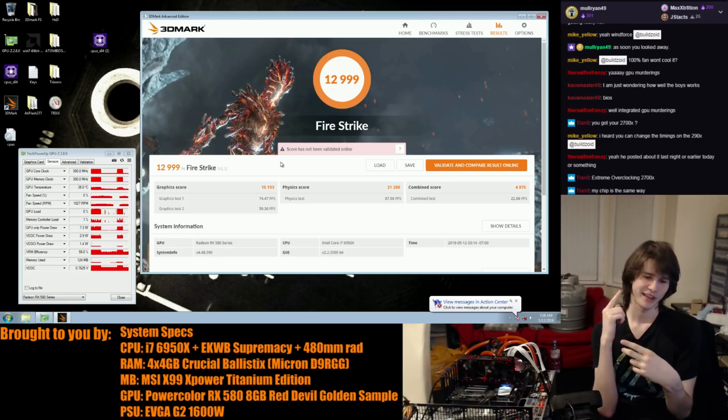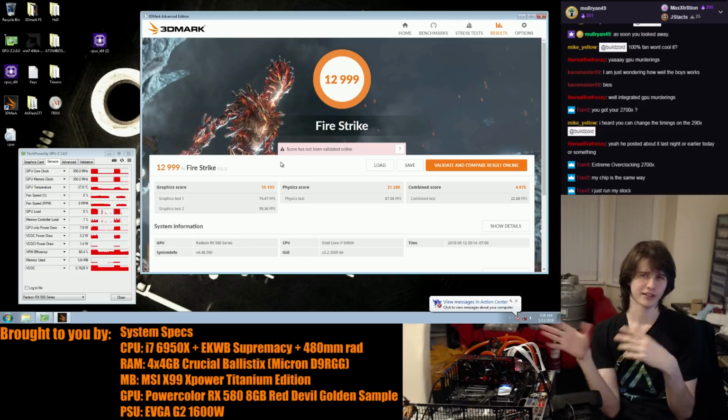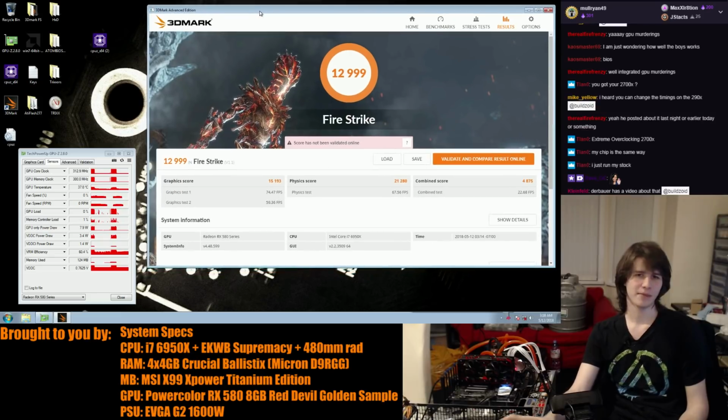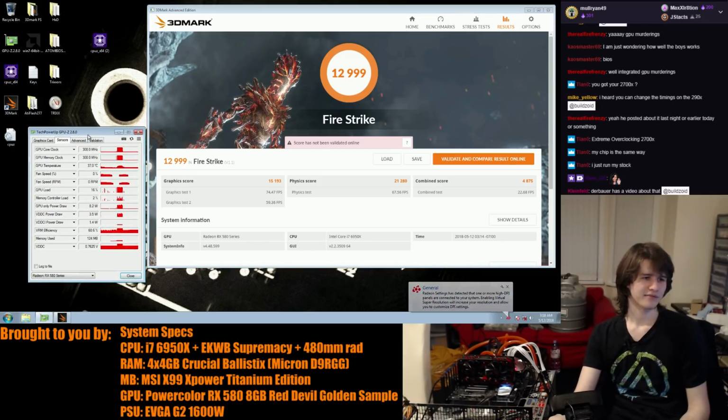and I've tested that with stock, 2x ratio, 5x ratio so far. I've not tested the entire range yet, but stock, 2x and 5x all score the same across every one of those tests, and it doesn't seem to be doing anything. It might be the motherboard, and I'll try other boards, but right now it looks like if you don't have BCLK overclocking, Precision Boost Override seems really useless. I don't know what's up with that.